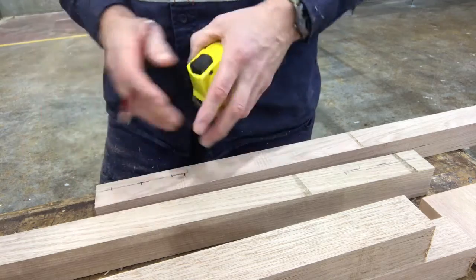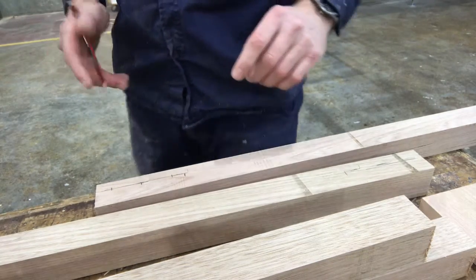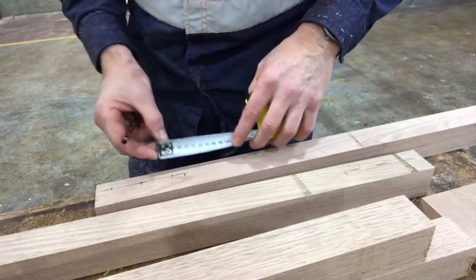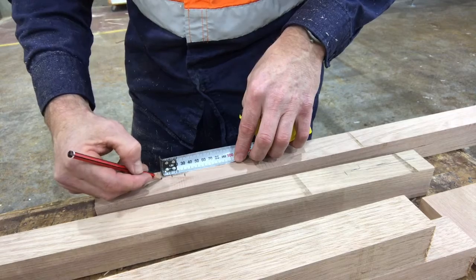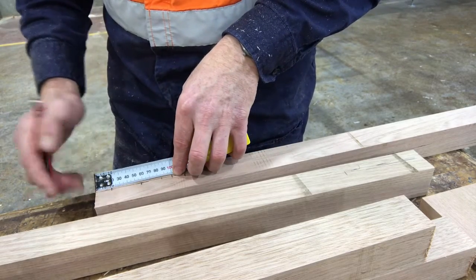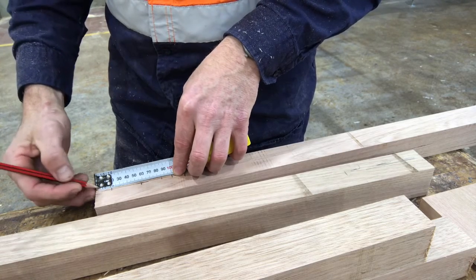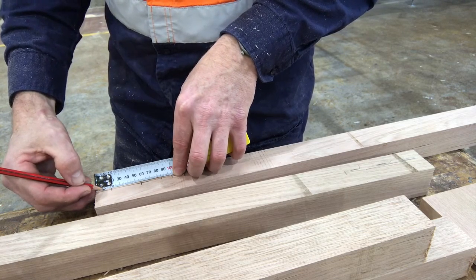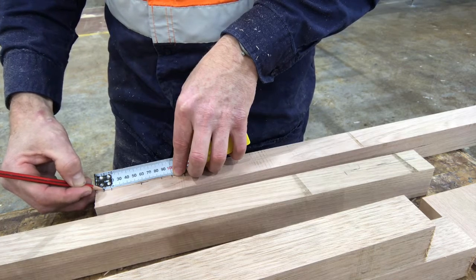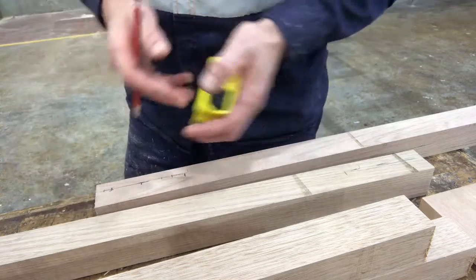Now, what you've got to think of also is we ripped that up, we've got to join. The bottom one's 30 mil, so coming up from the bottom, that rail's at 30 mil, that's all right. That's going to be smack bang in the middle of that rail. This one here, that top one was about 18 mil. So we might actually be better. I'm going to put that in at 10 mil for that one. So you get rid of that one. Then we go 10.